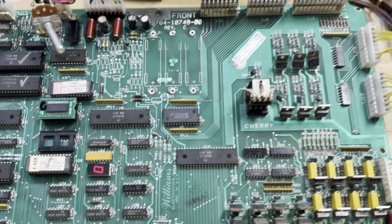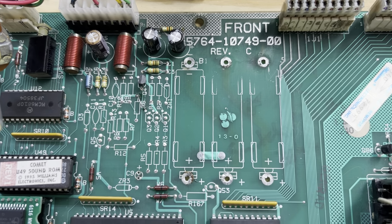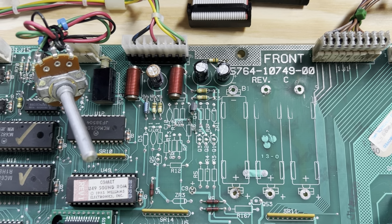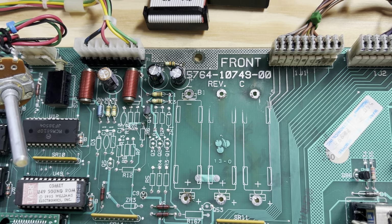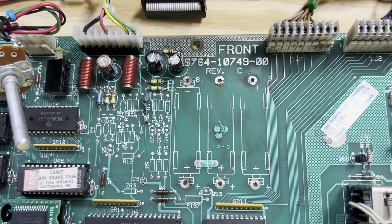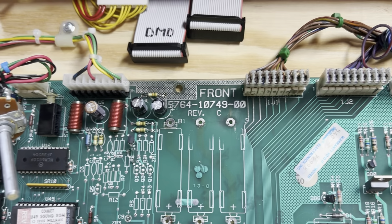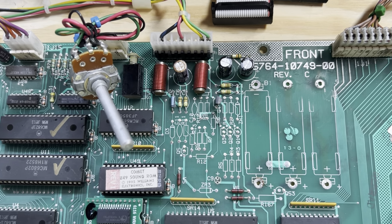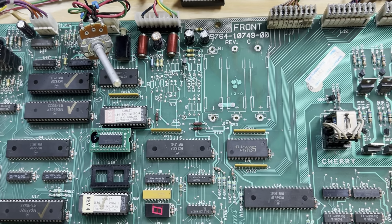Now this MPU had some alkaline corrosion, and the client, or somebody, had taken a whack at abating it. Did a pretty good job there. Those traces are tinned rather than conformal coated. I guess tinning is a form of conformal coating, but it just takes longer to do it like that, and I just spray it with a conformal coating now. But anyway, it looks like the corrosion was abated, yet the board was unreliable.